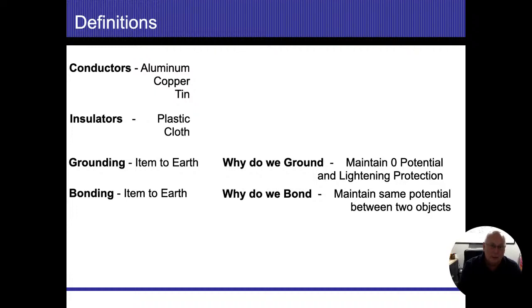But all that stuff is still energized. It still has potentially more electricity. If anybody touched that and they touch another pathway, then they're going to also become a conductor, and that's why that's dangerous. Anytime we have electricity going someplace that it's not supposed to go, we want that power turned off as soon as possible. All right? We don't want it to stay on. We don't want to let that extra electricity go someplace. The only thing we're trying to do with that grounded connection is keep that zero potential. Keep everything in the house at the same potential so that anything that I touch inside after I've been outside will always be zero or whatever the earth is, and I won't be getting any shocks when I touch anything.